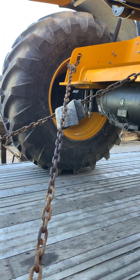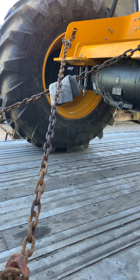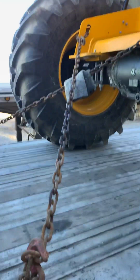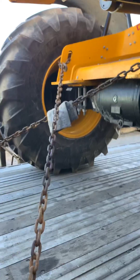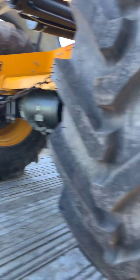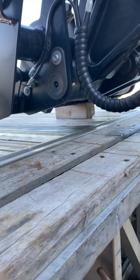You can see I use my little chains to come up out of the bed. Here I've got them crossed — it makes it a little bit sturdier here on the front end. And what else helps is that boom setting all the way down. It makes it hard to even get them on there and go up underneath of it. So that's why I've got it this way, so I can put the boom up on the deck.